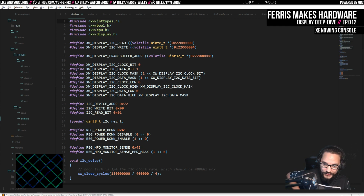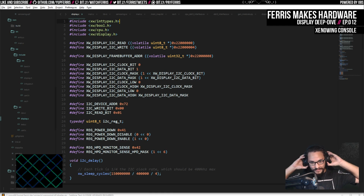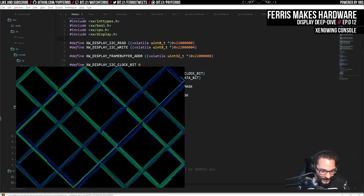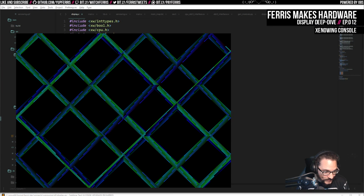The whole display stuff. I'm actually extremely proud that I got this working. I thought about it at some point yesterday, and it kind of clicked in my head. So I've got to go back a little bit, because I was originally thinking 640 by 480, just because that seemed like a natural resolution. And it's also one that I've gotten this chip to display before. One of the reasons why that's a good resolution is because a lot of monitors still support it, whereas if you go below that, they don't necessarily. In my limited experience, but experience enough. So I wanted to output 640 by 480.